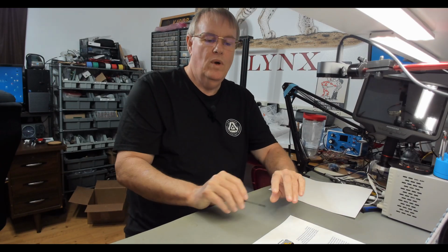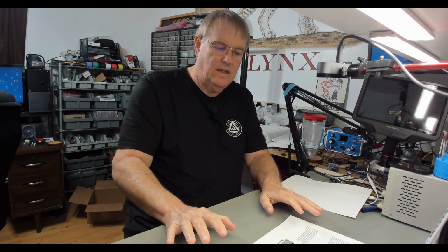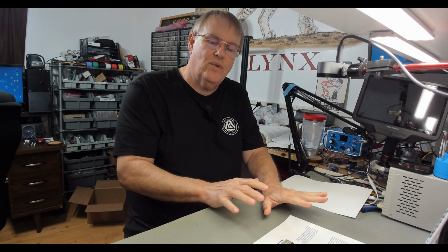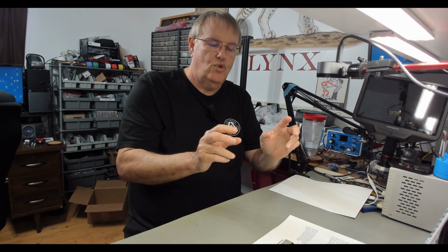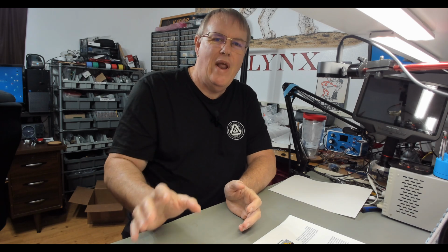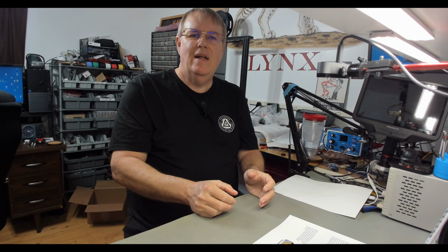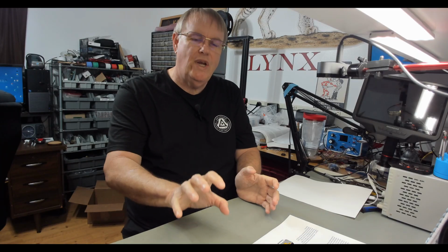Another one that comes up is when we have two circuits in a radio, and one is a 100 ohm, or let's say it's 50 ohms, and this amplifier it's connecting to is 200 ohm input impedance. Okay, so we got 50 to 200. We got a massive mismatch. We can't transfer energy very effectively to that amplifier. We will put something in the middle. It might be a transformer, or it could be an inductor and a capacitor set up to transform the impedances, meaning that the first circuit will see 50 ohms load, and the amplifier will believe it's being fed by a 200 ohm source. And so both of them will be happy. And we say that it transformed. We'll say that this circuit transformed the impedance. That doesn't mean it changed the impedance of the circuit. It means it worked like a translator between the two of them to make them happy.